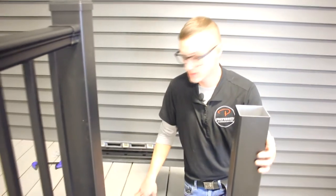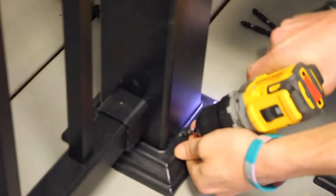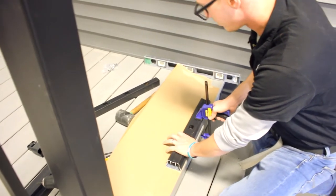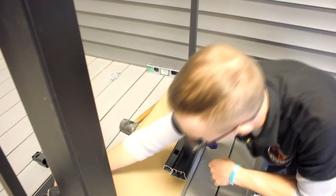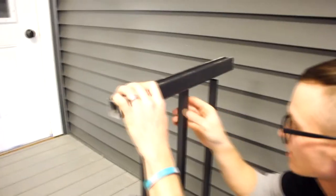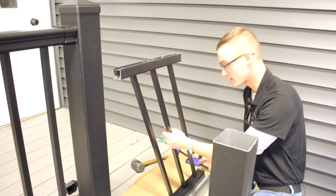Now that we've got our bottom post cut and rails cut, this is the best time to get our base covers on the posts — that way there's no rail or bracketry getting in the way. Now that our posts are ready to go, take the top and bottom rail and lay them down on the side. Use some cardboard from the packaging to protect the top rail. Get it on a table or deck, clamp it into place, match up the top and bottom markings on the rails, put in the 33-inch balusters snug all the way into the top rail, then take the bottom rail and from one side get those into the slotted stair holes, making sure it's seated all the way down. Now we've got our stair section racked, we're going to get our brackets on, clamp to the post, and get it ready to mount.